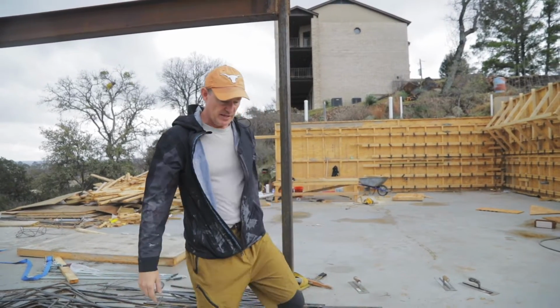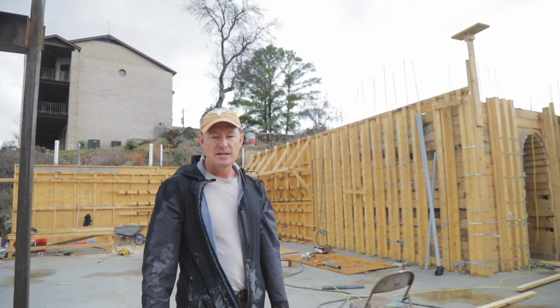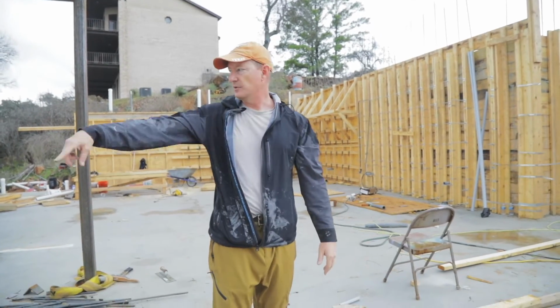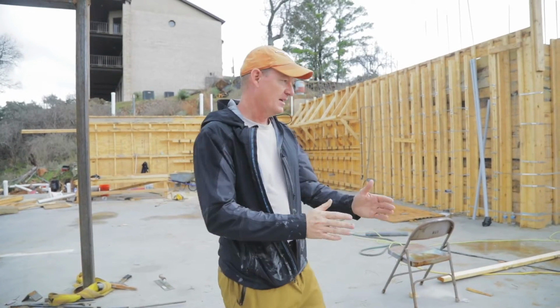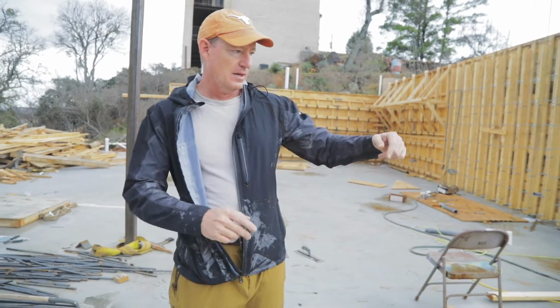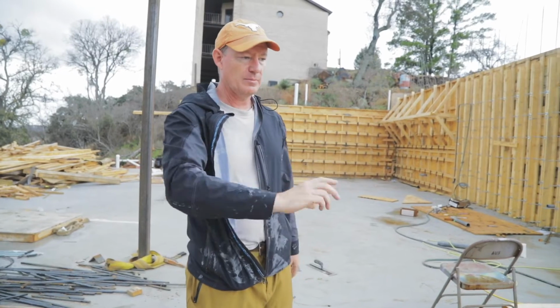The only expensive thing is the foundation. And technically you don't even have to do the foundation. You can make it out of wood. In Texas we do foundations because the concrete is cheap. But if you get a relatively flat piece of land and you do the exact opposite of what we did here to make it cheap, you only want about 8 inches of exposure, so it's completely flat, and you just take a 2x12 and frame it up on the outside, run a couple plumbing runs.